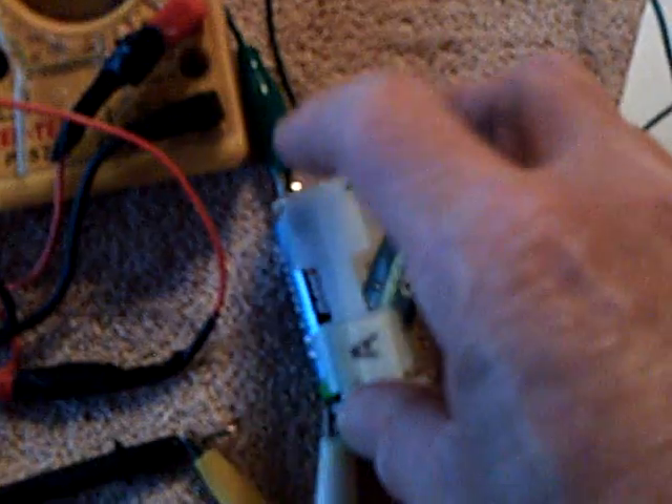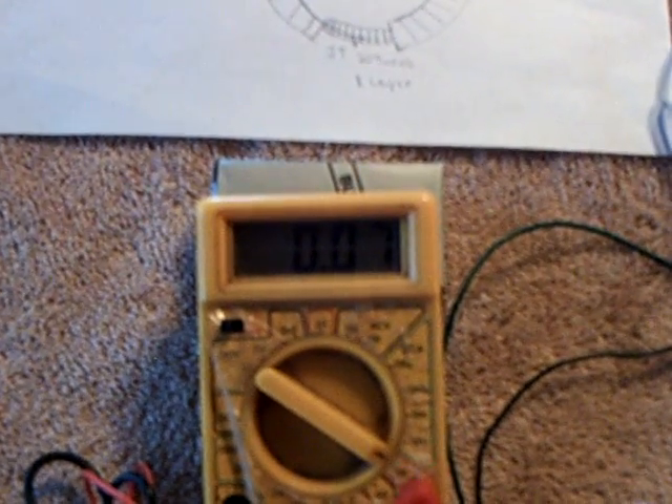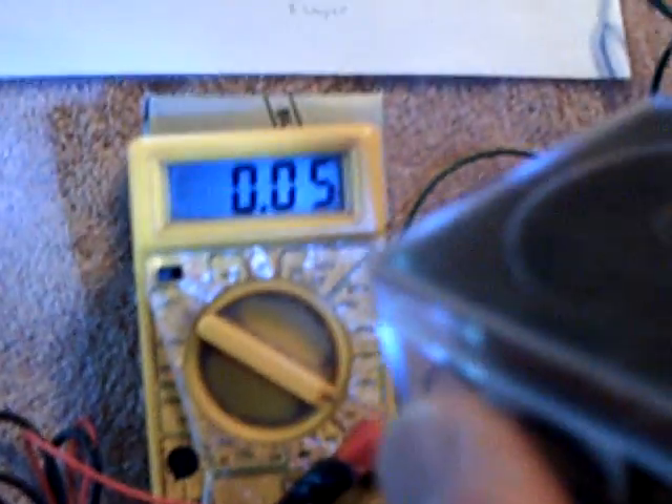Now I'm going to put in this other battery and bump the voltage up to about two and a half volts. I'm going to put this back down to about 50 milliamps — there's 50 milliamps on the draw. Now my cap voltage is up to almost four volts. I'm going to turn this other CFL on. This one draws 230 milliamps, though I can dial it down to about 70 or 80 milliamps. These inverter circuits are actually not very efficient and draw quite a bit of amperage. But there are the two lights side by side.